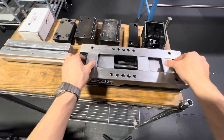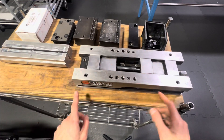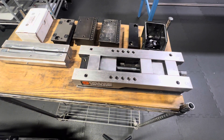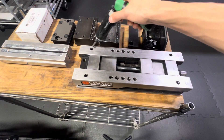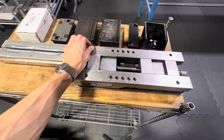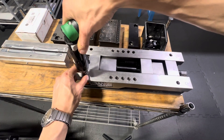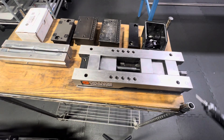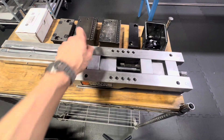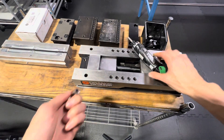Once we have that, we're going to install a fixed jaw and a sliding jaw. First we're going to need a screwdriver — it's a quarter inch — and we're going to unscrew these set screws. These set screws just plug the holes so chips and coolant don't get in, mainly chips. Now each hole is precision bored, so they can also hold locating pins. We're going to put in two half-inch locating pins.